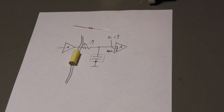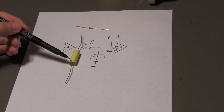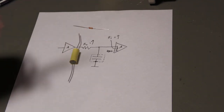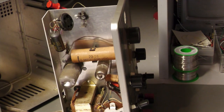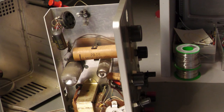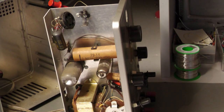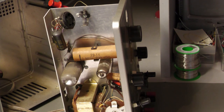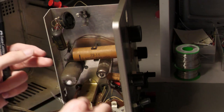So when designing or repairing, you want your capacitor placed so that the shielded side faces the lower-impedance node. It doesn't have to be ground — just always place it toward the lower-impedance side. When replacing capacitors in my Heathkit capacitor tester, I need to make sure the outer foil goes to the lower-impedance side — so I just match the orientation of the new capacitor's outer foil to where the old one was. The outer foil side is already marked on the Heathkit capacitors, but for unmarked ones I need to find it. I already did this for one capacitor and marked it — now I'll show you how.